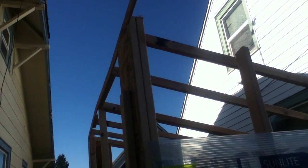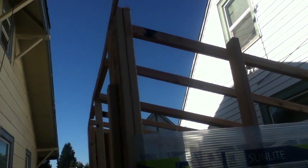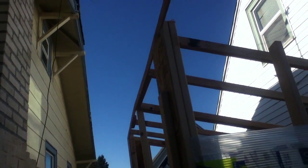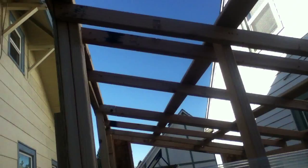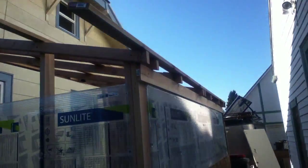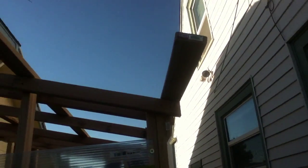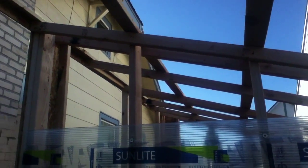We can't do any roof overhang on the flat side that's going to get attached to something, but if I'm going to leave it someplace for a while, I can get my little ridge cap and stick it on there, and that gives me a little overhang for this side. So the top's trimmed down and our long boards are going in. This is what's actually going to support the roofing material. Normally you wouldn't be able to support that much roofing material with a close-to-two-foot gap, but these are three-and-a-half inch wide boards, roughly 24-inch spacing, which is within specification for the Dura roofing material.